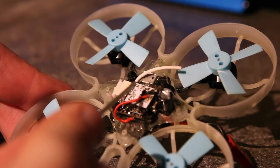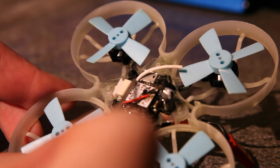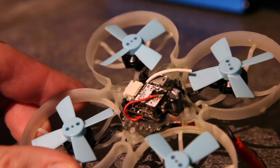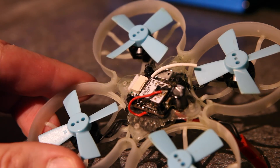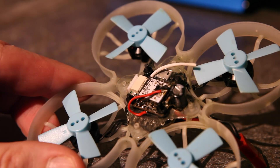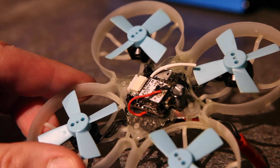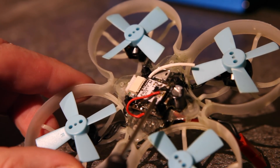The other thing you can see under here is this whiteboard. This is the Full-Speed RC Nano FrSky receiver. And this white wire, which goes under the canopy, is the antenna. This receiver plus antenna - the whole thing is half a gram, and that's why I picked it for this build. It's super light. It's D8 and not D16, and the range is not amazing. I've never had a failsafe because of range flying this thing, but my transmitter does let out a kind of annoying high-pitched squeal every once in a while complaining about low signal strength. So this is definitely not a long-range receiver. I haven't had any actual problems with it, so I haven't replaced it yet. I do have an XM receiver that I might switch to for better range in the future, and there's lots of room underneath the ESC to mount something like that.